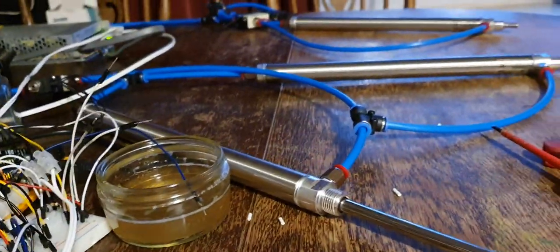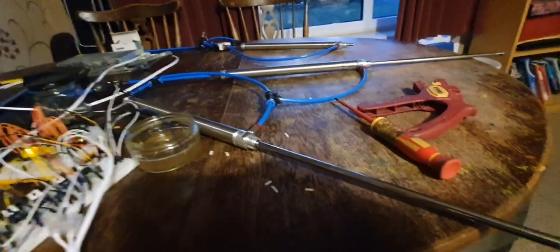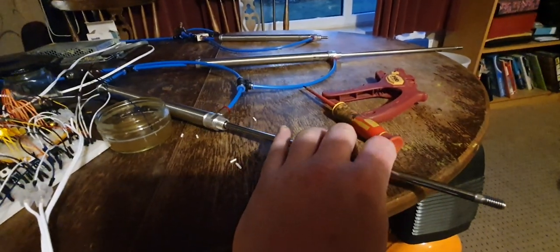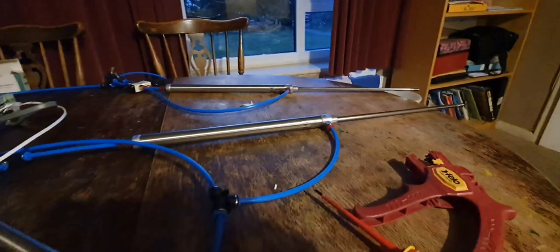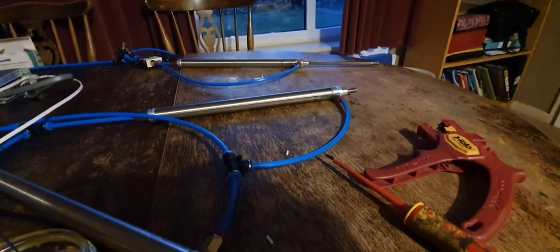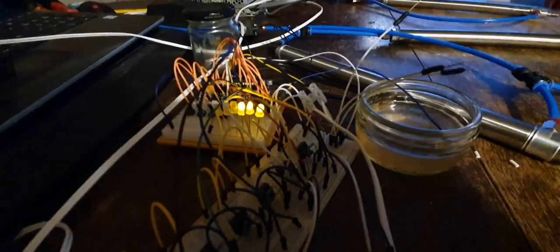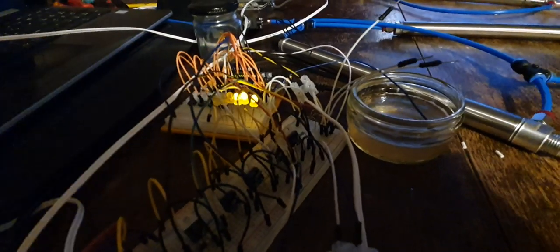Let me just get down a little bit and I'll see if I can walk you through the process. So if I just zoom out a touch, you'll see that both of these cylinders are in the out position. So if I start the cycle by pressing this button here, we can see over there that the can push cylinder has retracted. The fill heads have dropped. The can push cylinder extended, not retracted. And then now, the fill solenoids would be open. That's indicated with these three LEDs here.